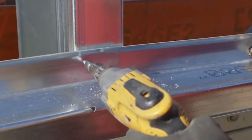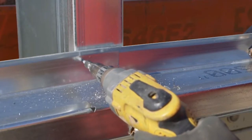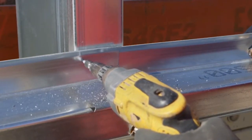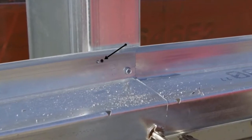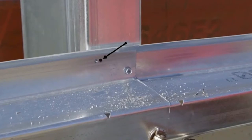While erecting your building, the occasional self-drilling screw will burn. When this happens, it's not exactly a burn that takes place, but an overheating of the screw itself. This will also heat and harden the steel you've been drilling into. For that reason, it might not be possible to install any screw into that same partial hole.